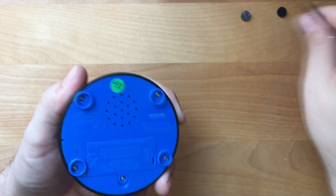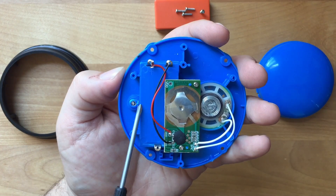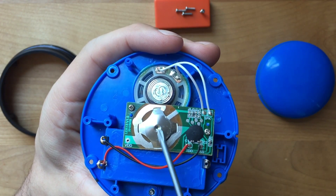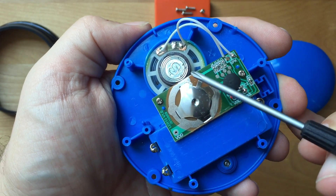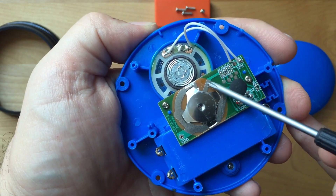When you take off the feet, you'll see some screws underneath. Take out those four screws and the whole thing comes apart. Inside you can see the battery case, a speaker to produce the sound it makes, and this board here. This blob contains the sound chip, and this big metal piece here is what's called a dome switch. They're pretty common in tactile buttons like these, or in older game controllers like the ones for the Atari 2600. They're cheap but very reliable. We're going to disconnect the battery compartment so it can no longer produce sound. I could take out the speaker, but it isn't bothering anyone. The way that this switch works is that the outer perimeter of the dome touches one contact of the switch. When the dome is compressed, the middle part of the dome touches the other contact, which is underneath it.